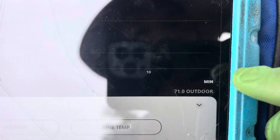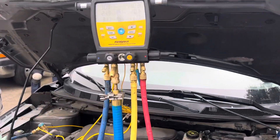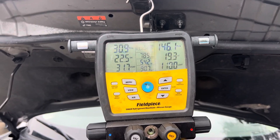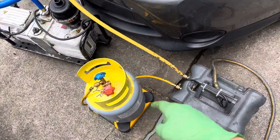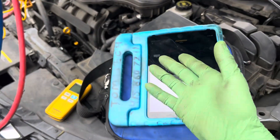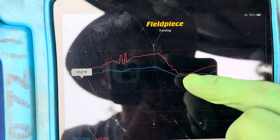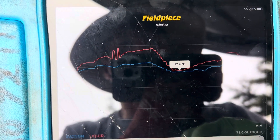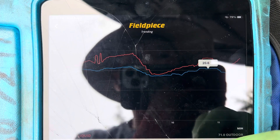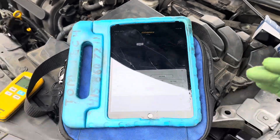As you can see I'm going into minute 10 right now, going up to minute 11, and we're going to look at superheat and subcooling — we're not even going to pay attention to pressures. This is YF refrigerant. Let's pull the refrigerant out of here, see how much comes out, fill it back up, and look at these numbers again. We're going as low as 17–18 on the superheat and subcooling, hitting as high as 25–27 on the subcooling and 20–21 on the superheat. Pay attention — it's constantly repeating that pattern over and over.